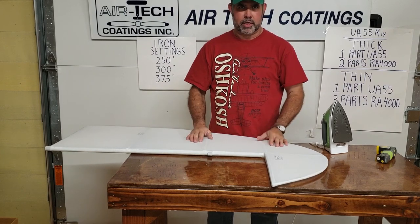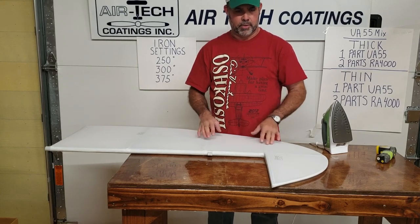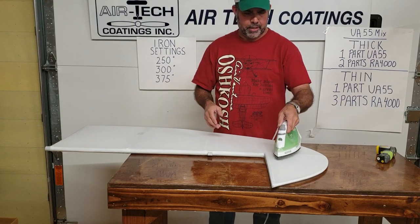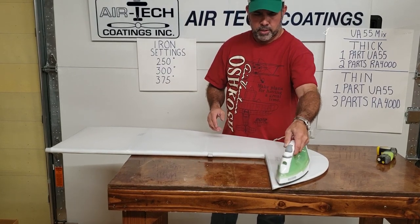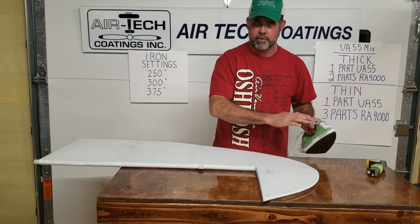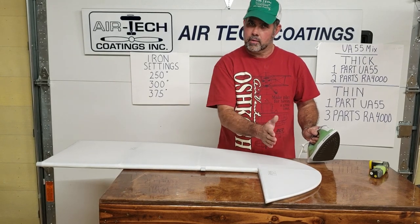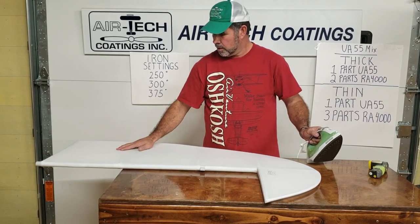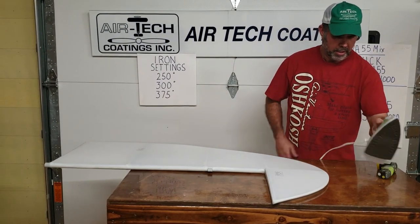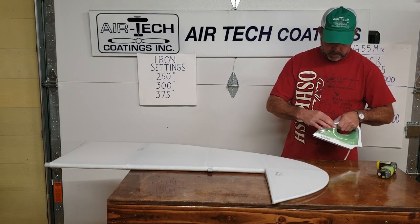On an experimental or a Piper wing, I may add an extra U channel to brace all I can. If you have an area you're afraid might pull too much, ease off about halfway through the final pass — as long as it's tight, the fabric primer will set in and it'll be fine. All right, this one's considered shrunk. Next video we'll look at putting the reinforcement tapes on.